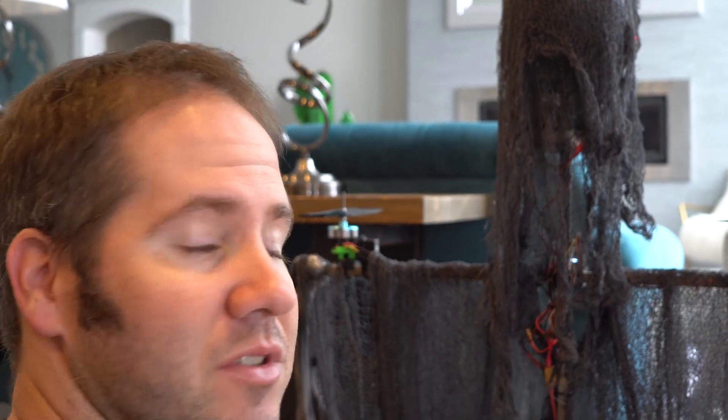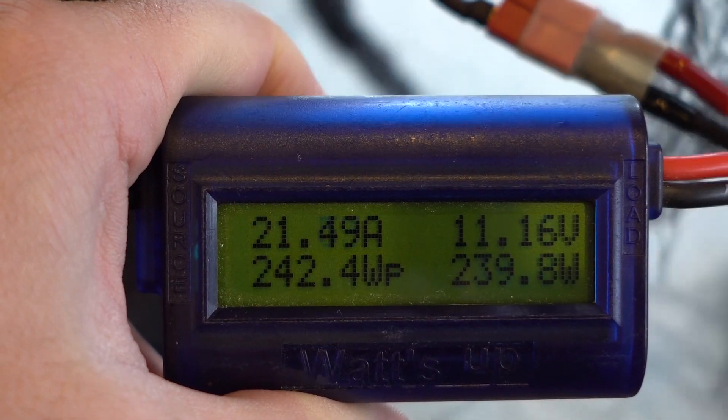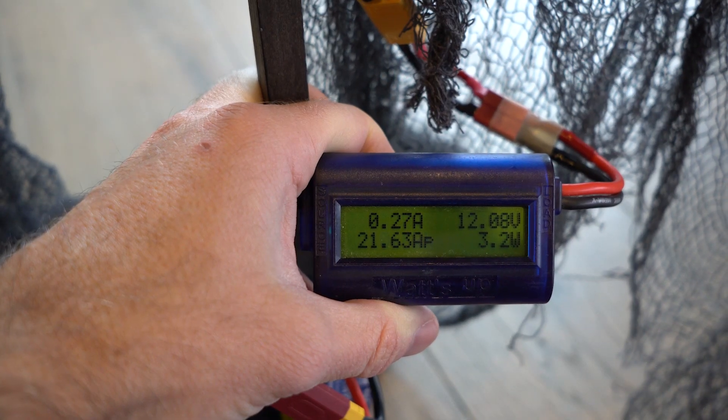So where is that 100 watts? I think one of the things is that the autopilot leaves a little bit of headroom on the top of the throttle so that it has some maneuverability and you're not ever maxed out — that way even at full throttle it still has headroom to stay level. I don't think there should be another 25% power left on the table. I looked at the manual and I think there's a procedure I skipped that calibrates the throttle, so I'm gonna go ahead and do that. But that actually gave us less power — it totally didn't work. It's back to the drawing board.